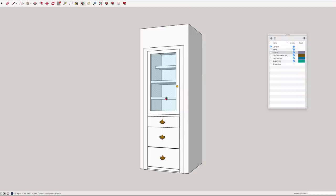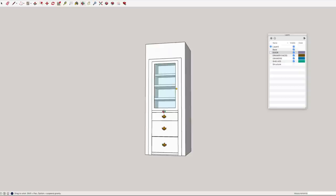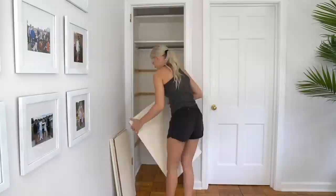The first thing that I did was clear out the entire closet. I took measurements of the closet and designed everything in SketchUp so I could figure out all the dimensions for my drawers, shelves, and glass door. If you don't have a design program, I recommend sketching your plan on a piece of paper and marking your measurements out that way. You'll have to remove the door to your closet and remove any old material and shelving that you aren't going to use. Be careful removing any material that you are going to repurpose. I ended up reusing the old wall cleats for my new shelving.